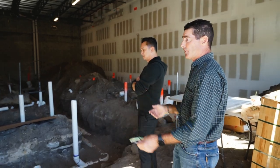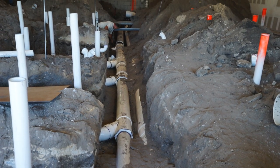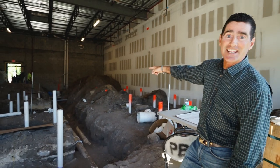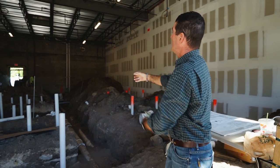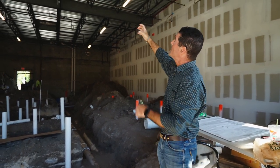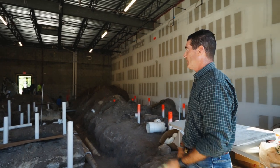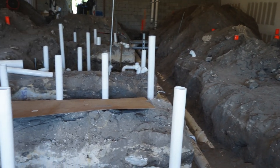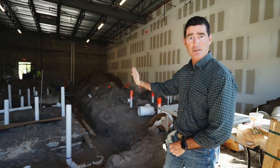This is the beginning of the underground. You can see some of the pipe sizes — we've got four-inch risers going to eight-inch pipe, going to ten, going to twelve, going to sixteen. These sixteen-inch pipes will then go up at the back of the space, be picked up, and go into the big ERV units. That's how they recycle the air. It's messy and ugly at this stage, but it's one of the most important stages — everything has to be exactly in line, perfectly.